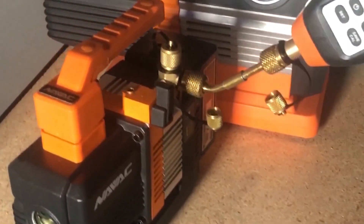This piece of data is included not just on this pump, but on every vacuum pump NAVAC manufactures. This is not just a flashy buzzword for marketing purposes — it's an extremely valuable and applicable piece of information that a technician can use to performance test the pump. By hooking up a micron gauge to the quarter-inch port of the vacuum pump, turning the pump on, and observing the reading, you will be left with one of three outcomes.